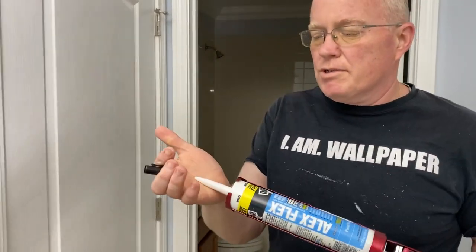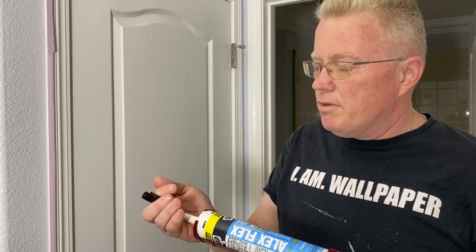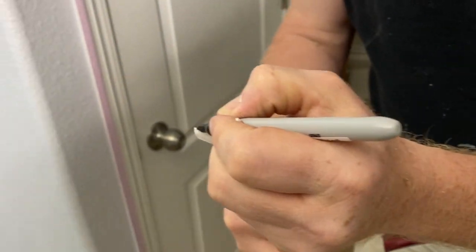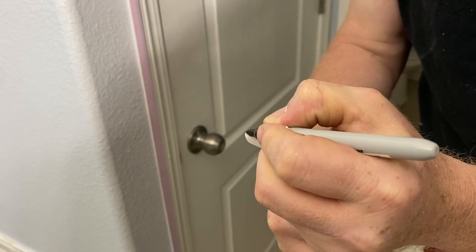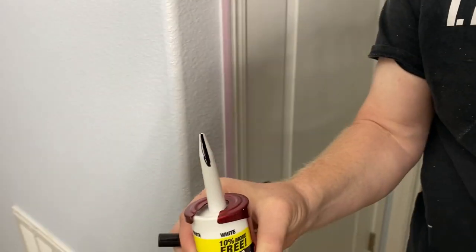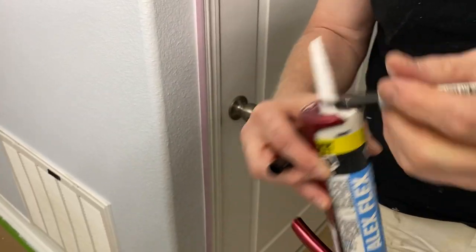When you have caulking coming out of a caulking gun, can you tell where the orifice is from which the caulking flows? No. I'm going to help your job go quicker. There's the orifice. Mark the opposite end so that we know — when it's loaded up — that the point from which the material is flowing is the opposite of our magic marker. Believe me, it'll save you time and aggravation. There's nothing like running a bead of caulking down three or four feet and realizing you're shooting it toward yourself.